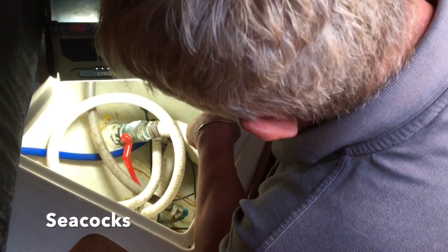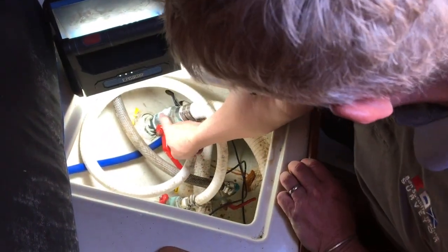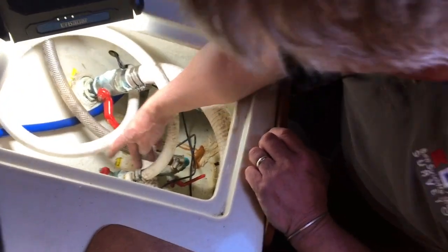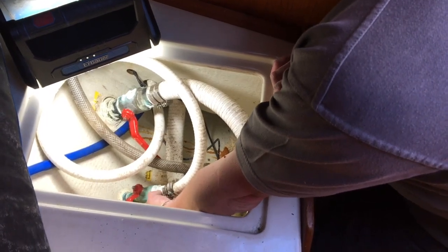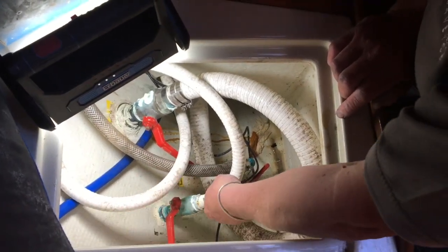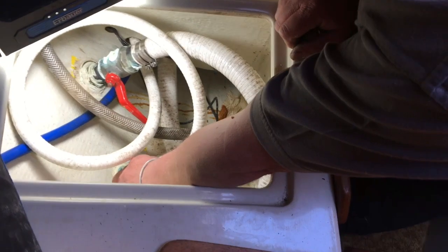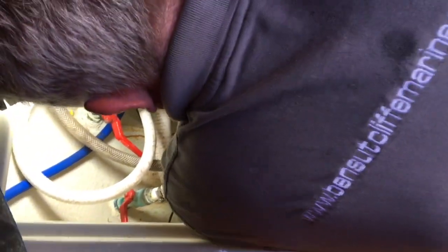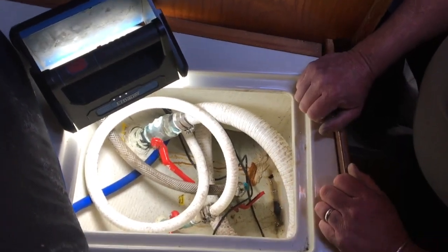So we've got three sea cocks in here. They're clearly over five years old with massive corrosion on the actual fittings. But more importantly, it's the hose tails. This one makes me laugh because we talk about double clamping, but the actual double clamps are not on the end of the hose tail - they should be nearer the shoulders of the fitting. This one on the end isn't even on the fitting, but they double clamped it - completely pointless. All three are definite replacements. The handle on this one is pretty much seized. Frankly, over five years old - chuck them out and start again.